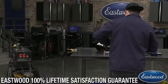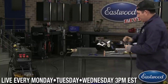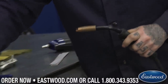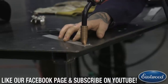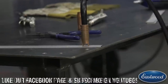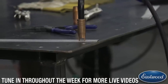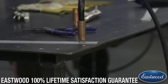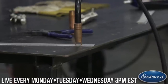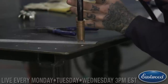I'm going to cut this wire down a little bit ahead of time. So you thread this on and what this is going to do is give you a perfect standoff. This gets you the perfect height off the panel so that when you're welding, you don't have to worry about your hands being unsteady, or if your welding helmet doesn't have a great range on it, or your shop lighting is poor. If you have the standoffs touching and the wire cut correctly, it's going to be set just right to do a weld.